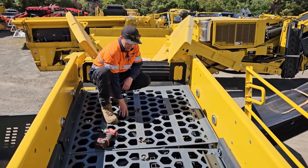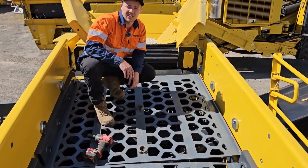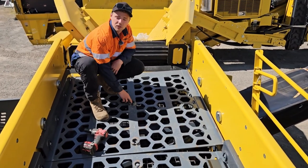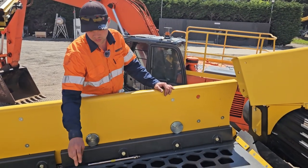Once you've put the new punch plate back in, first install the middle bolts loosely, and then do the reverse procedure — tension the sides, and then do these middle bolts up to last. After you've put the middle bolts in finger tight, then install one tension bar on one side.